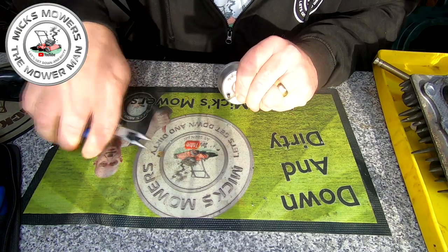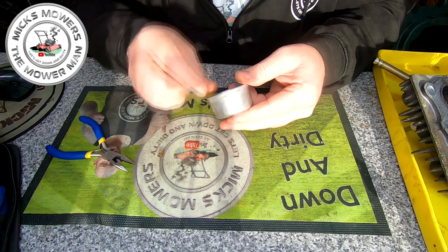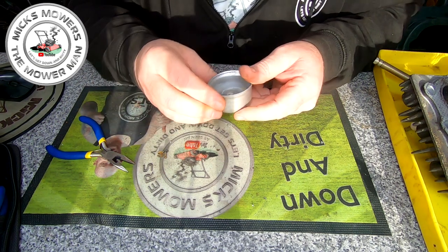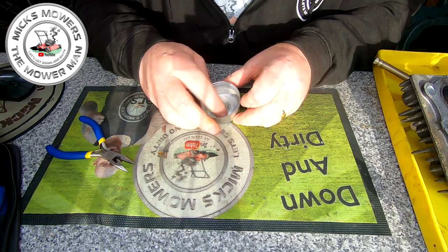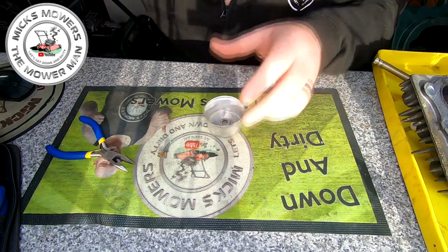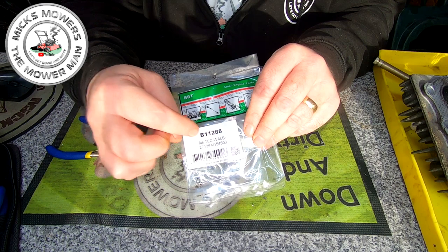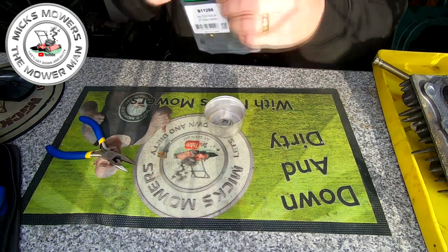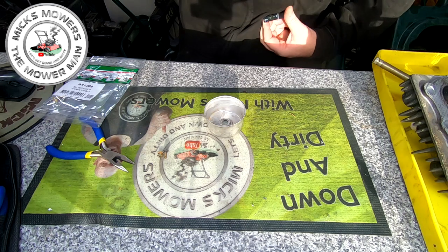There it goes — the spring has shot off but I don't need the spring. That thing just comes out like so. Now you can get a little bit of wire wool in there just to smooth those edges up. Your new part is, as I say, from JAP Garden Machinery or JAP Machines, part number BRV01128 — they're about four pounds each.